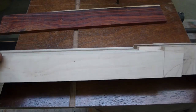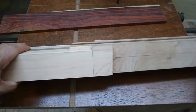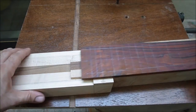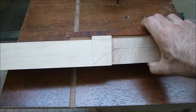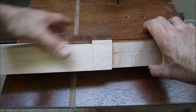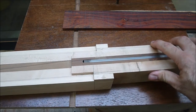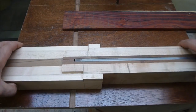Also, if you notice, I've routed this top face with this little notch protruding. This is where the fretboard is going to sit. I did this in order for the top to be grooved in — inserted here — so any edging edges will be hidden from the eye. So it will be a neater, more beautiful joint.